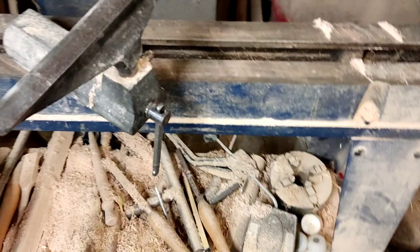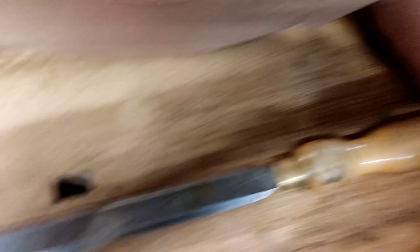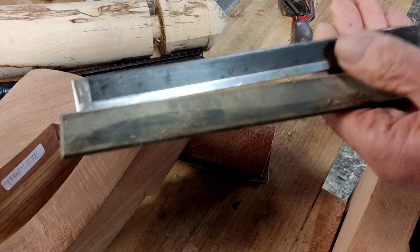This was acquired a long time ago — it had probably been dumped. These are high-speed steel blades out of the electric planer. Oh, a big planer. And that's what you made this chisel out of? That's what I made that sort of. If you grind it down — if you want the edge — you grind it down on both sides to match to the bevel edge. And then grind your bevel. Originally, that was probably longer than that. So you made your own chisel?